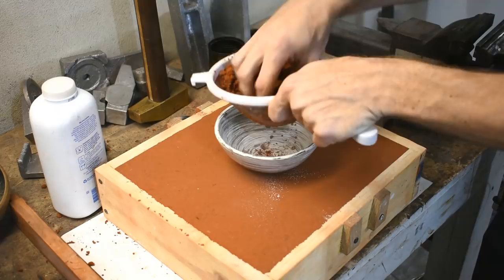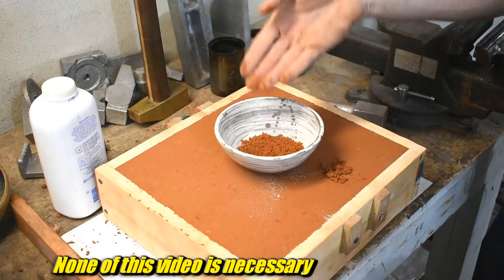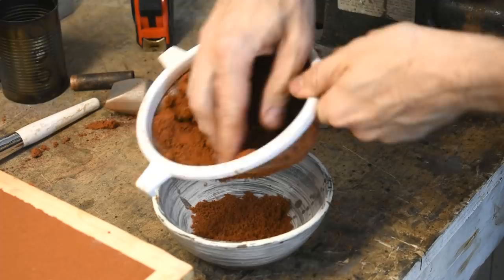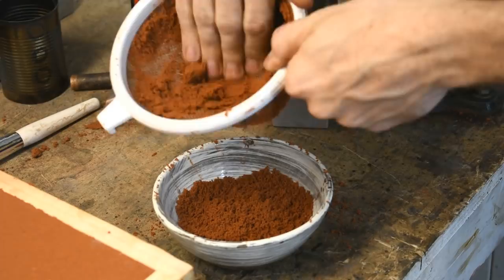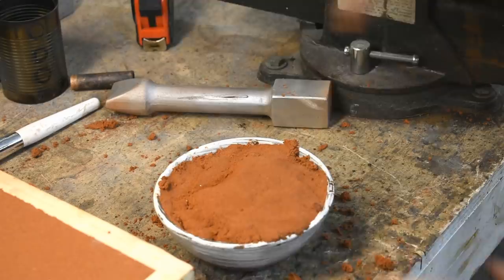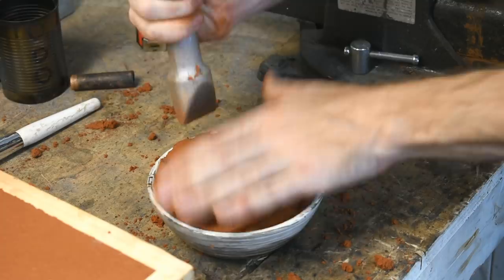Is this even necessary? I mean, this is a glazed surface — it's the smoothest, glassiest thing ever because it's made of glass. Fortunately, if this fails, I can just say I already made a bowl. I'm taking the really long way around by starting with a finished bowl and making it into another bowl. I'm going to be very delicate with the sand rammer because I don't want to break this bowl, but I also don't want air pockets. I'm going to use the casting gating method I discussed in the last video with the hammerheads.